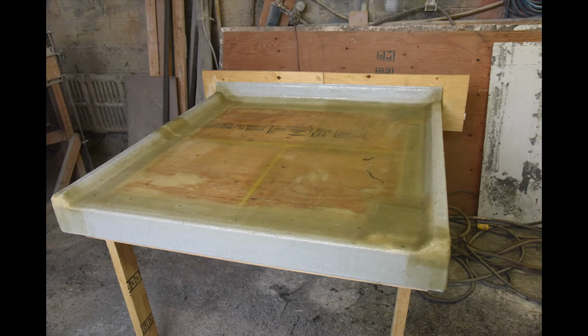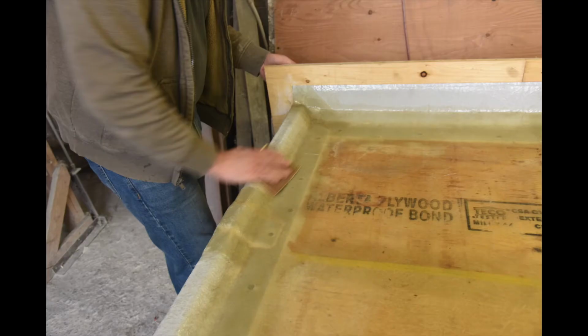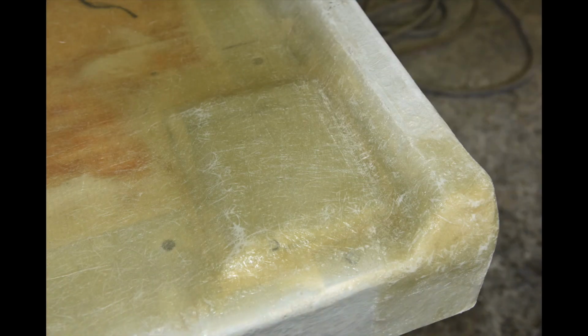After all the laminating is cured, which generally takes 1 or 2 hours, it's time to coat the deck with 2 coats of gel coat. First, sand the deck with coarse grit sandpaper to remove any loose fiberglass hairs or sharp little splinters of resin-coated glass. Pay attention to the bandaged areas. Finally, thoroughly sweep off the whole deck and pay attention for any missed spots.